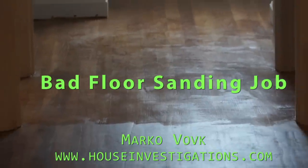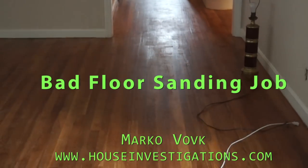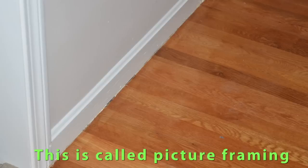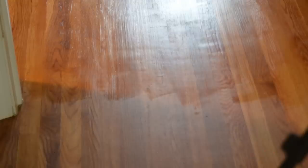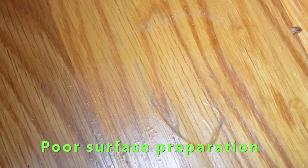This video shows what happens when you hire the wrong wood floor finishing contractor. You can see spots where there's a lot of sheen in the finish and other spots where it's totally dull and flat. Looking closer, you see long grooves going across the floor that appear to be from a sander — running parallel with the flooring boards — and hundreds of short divots running perpendicular to the boards where the sander ground into the floor, giving it a very uneven finish.